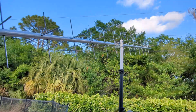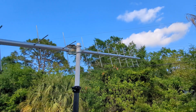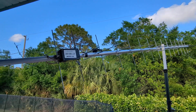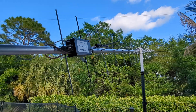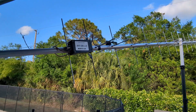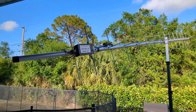With the moon going this way or that way depending on the time of year, I should be able to get plenty of view. It would suck if the moon's coming up over the horizon - maybe I'll take it to the beach and get right on that horizon. Anyway, that's where I'm at. I even questioned my RigExpert analyzer and put a 50-ohm load on there - it was a 50-ohm match, perfect, zero SWR, 1.0 to 1. So the analyzer's working. I don't know why I can't get the driven elements anything lower than 479 megahertz. Maybe I've got to take this apart. So that's progress of part two on my backyard EME moon bounce.